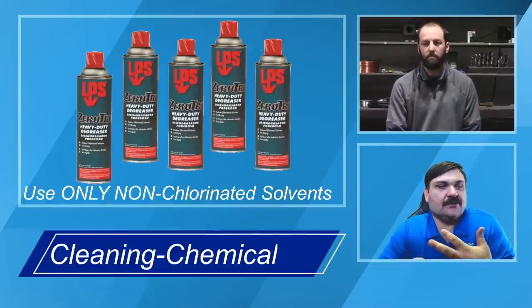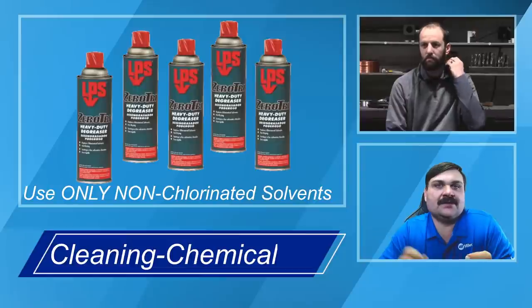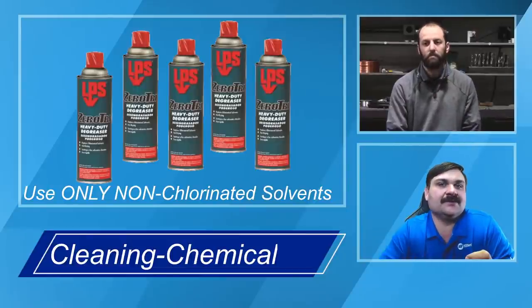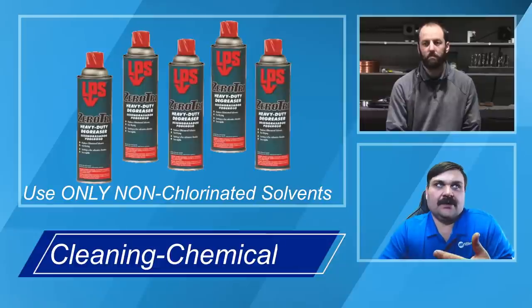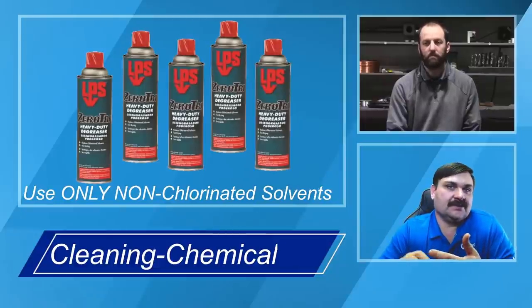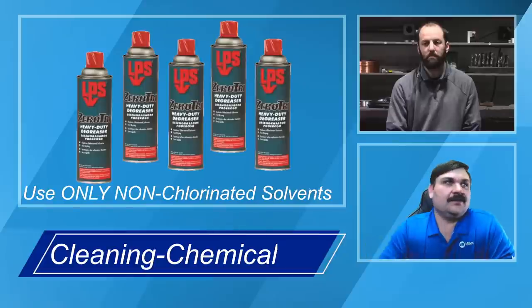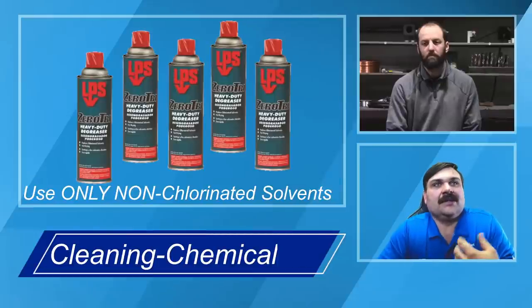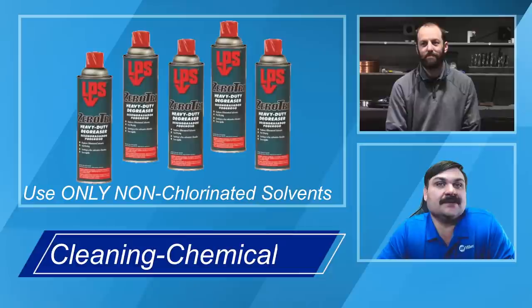Andrew also just mentioned oil from your fingers. If you're not wearing gloves, a lot of times if you're used to TIG welding all the time and you hit that spot where your fingers were sitting for a while, you'll see that arc flare. So that's why we're typically wearing cotton gloves in those environments as well. Because even if you're wearing gloves that you were using on steel or in an oily environment, if it's a mechanic shop, something like that, you can be driving that contamination from your filler material, not just from the base plate. So you got to be careful with making sure everything that you're putting into that weld is clean as well, not just the base material.